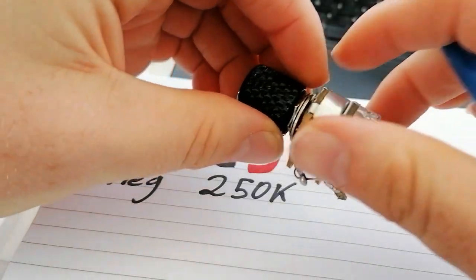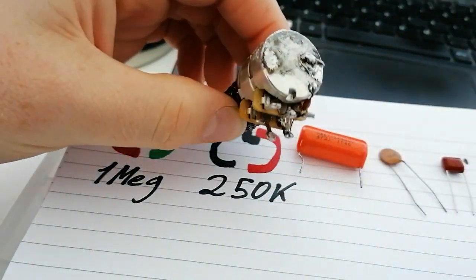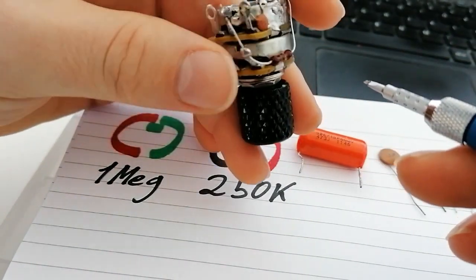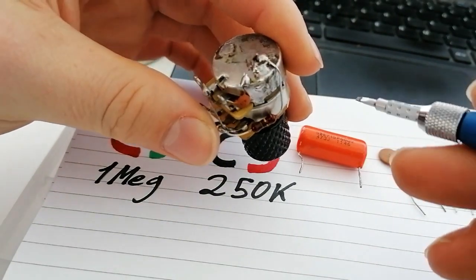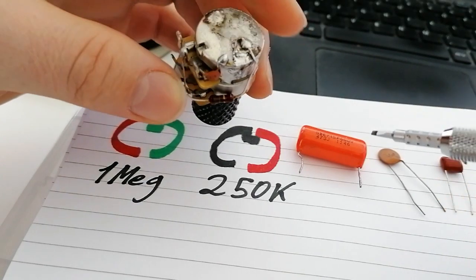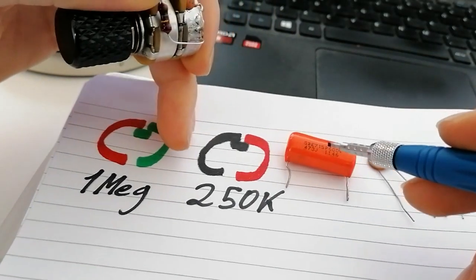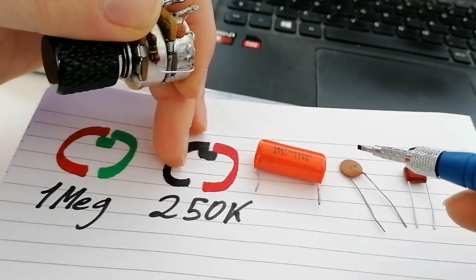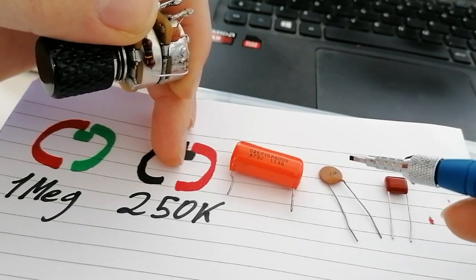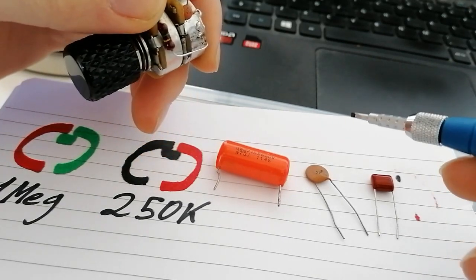If I turn the knob the other way, past the flat position and counterclockwise in playing position, the tone pot comes into play and it just works as any other tone pot would. The more I turn the knob, the darker my sound becomes. Again, the amount of frequencies that are sent to ground depends on the value of the capacitor I use. Modern basses usually have a 47 nanofarad capacitor. A 100 nanofarad capacitor can be found on vintage basses, which will allow you to have a darker tone. The higher the capacitor value, the more frequencies you send to ground when the pot is in use.